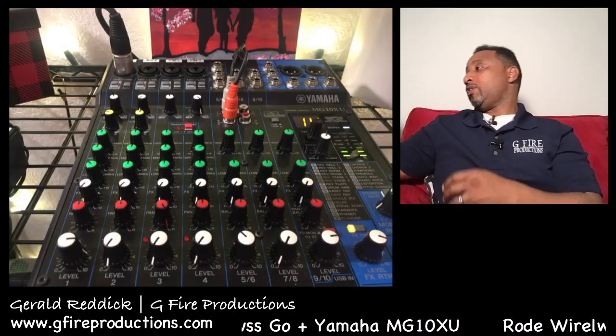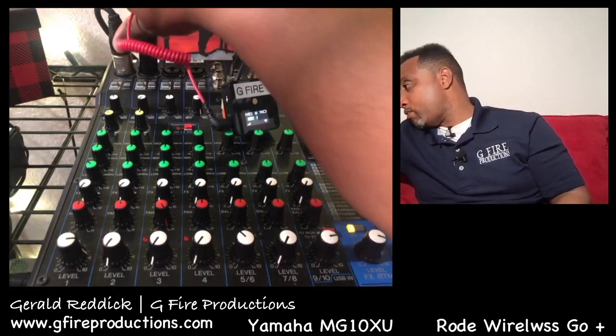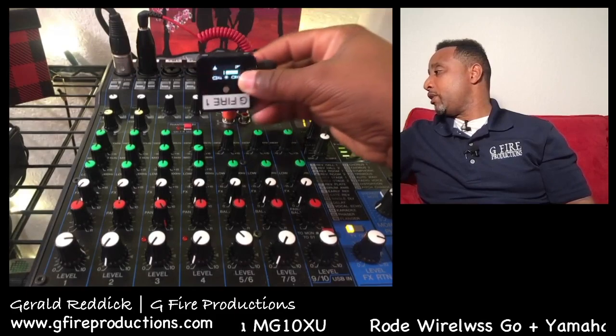Okay, so I hope you guys follow me okay. Now what is happening in the case of the VXLR is that it's taking in a balanced signal here and converting it to unbalanced here, versus this one, which is balanced here and finishing balanced here. So that's why the first two systems did not work. In this case, you have balanced going into balanced here and now unbalanced here. And when we plug it into the mixer, this is why we're able to get a signal right into channel 2 with no problems.